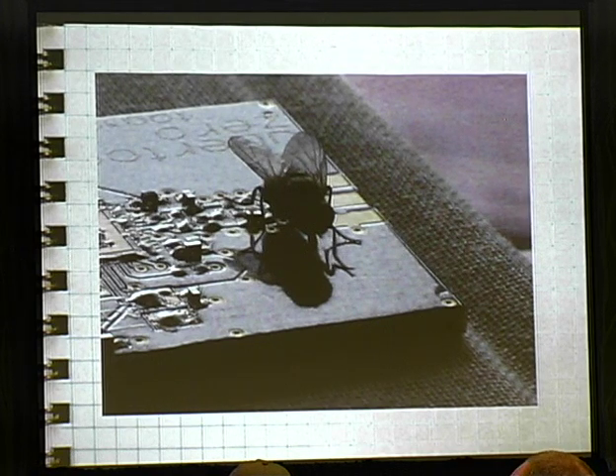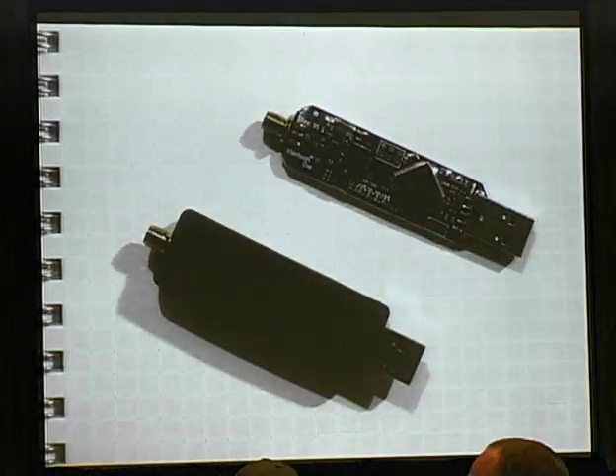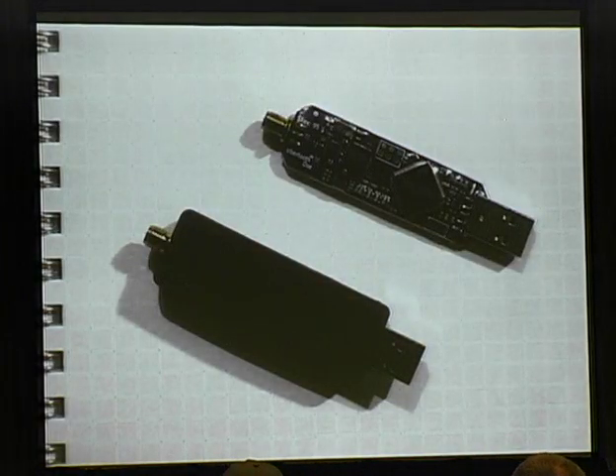Then you put the thing on an electric skillet, heat it up until the solder melts, and you're done. You should get yourself one of these infrared thermometers — you don't really need one, they're just fun to play with. It's thanks to these surface mount techniques that I was able to get it small enough to fit inside an enclosure. You can buy an off-the-shelf enclosure, but personally I prefer to just put a little transparent heat shrink around it. It protects it quite adequately, it's cheap and easy, and you can still see the blinky LEDs.